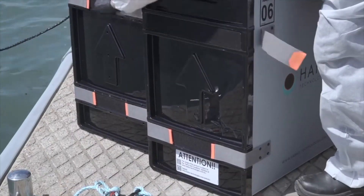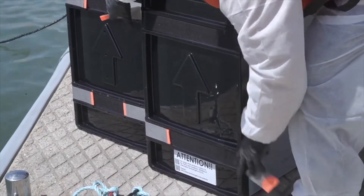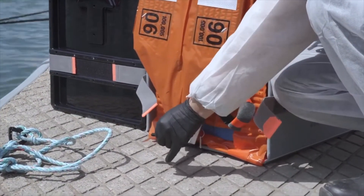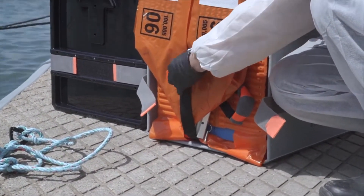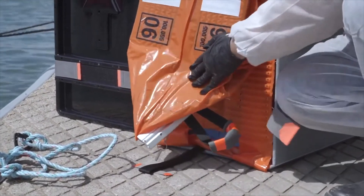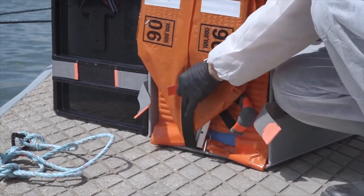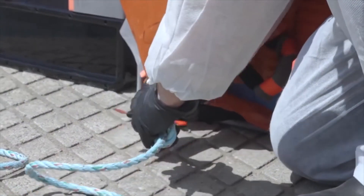Open the first cartridge for deployment. Each cartridge has a strap that's connected to the back end of the boom that you can see when opening the cartridge. By holding this strap, the operator is able to hold onto the boom when it is fully deployed and out of the cartridge. Attach the strap to the carabiner.